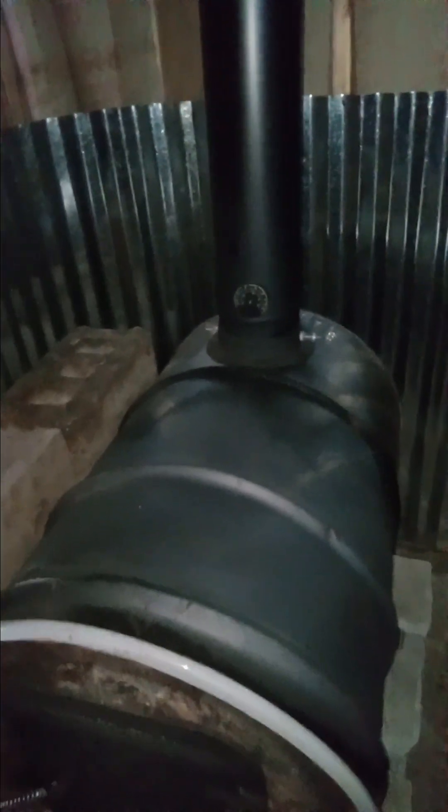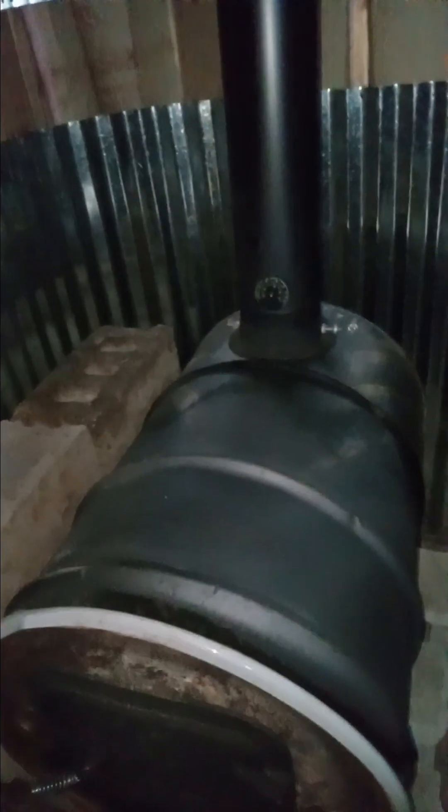375 is a very good burning temperature — when you're using the right wood that isn't wet, that's a very good flue temperature to be burning at to not create creosote in your chimney.